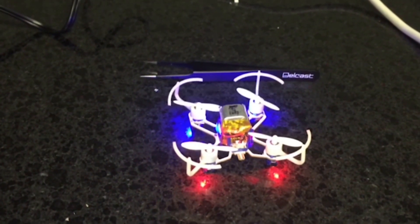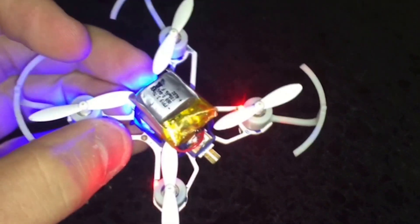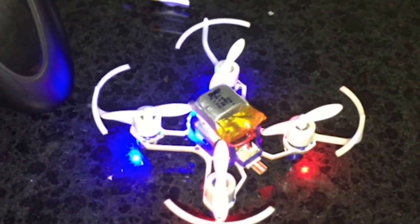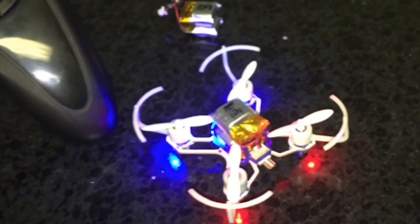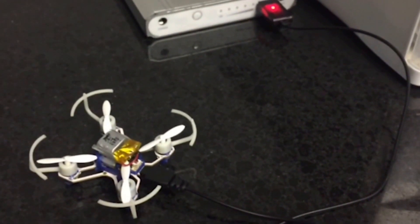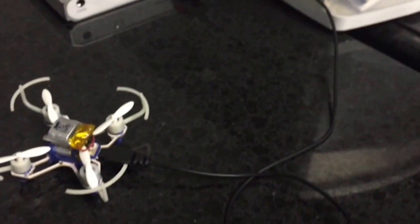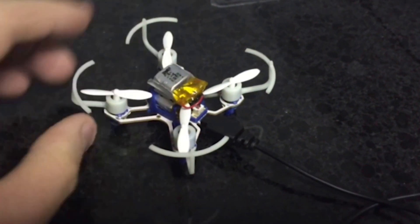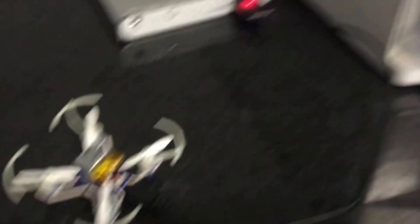So there it is connected. We'll go ahead and switch it on — we're good to go. Turn on the controller and we've got it. I'm going to do a test to see how long the battery lasts — be careful about these wires and make sure the blade is not hitting them. I just finished the flight test and got about seven and a half minutes of flight time — usable flight time is probably about seven minutes. That's definitely an upgrade over what I had, which was about three to four minutes. The batteries did not get hot, neither did the motors, and it was very stable to fly. Now I'm going to time how long it takes to charge both packs.